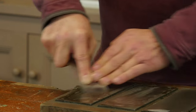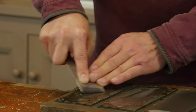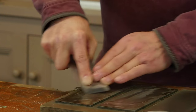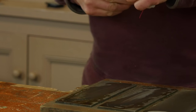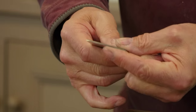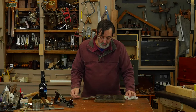The whole bevel again — so I'm getting my macro camber on here. Then I lift up and drop, lift up and drop — so the whole of those outside bevels are abraded exactly the same way. There's a burr all the way along that edge; I want to get rid of that.